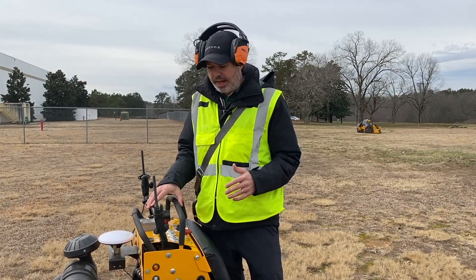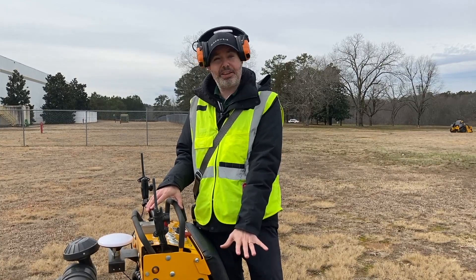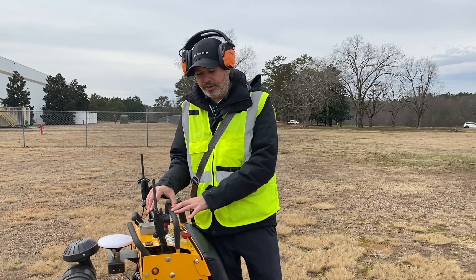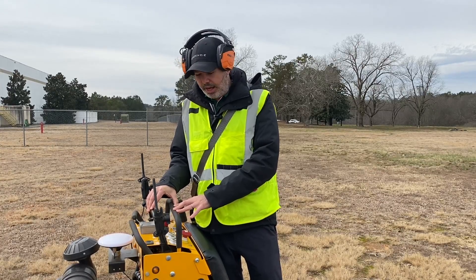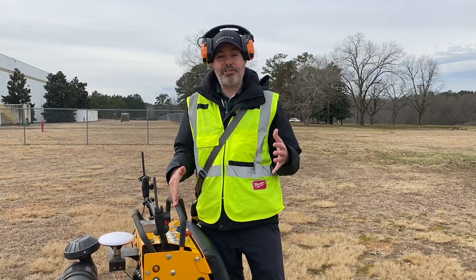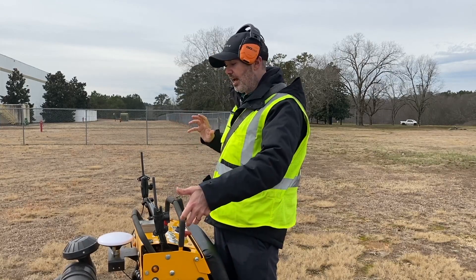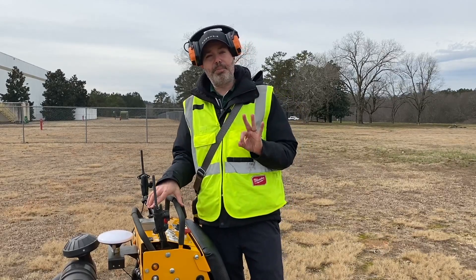It's constantly calculating. If our software tells a wheel to spin at three meters per second, it very quickly ramps up to three meters per second smoothly, using a PID controller to get there and tone it off. It doesn't jerk back and forth — we've tuned all that out — and it does a very good job of keeping right at three meters per second. If we need it to turn, one side might go three meters forward and three meters backward, and the system measures and executes it very quickly.